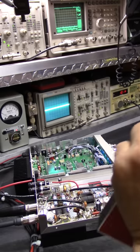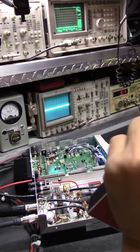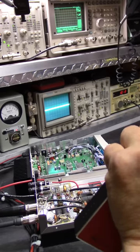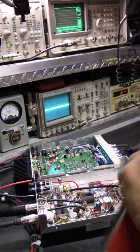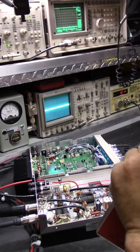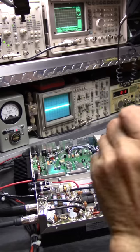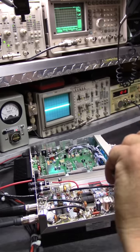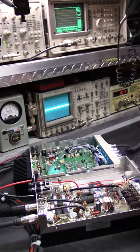Receive front-end overload reduces adjacent channel rejection. That can be a big problem, especially if you're in a truck or a heavily populated area. It could really piss you off. But that has a lot to do with who is inside your radio. So yeah, this one is just like the rest of mine. Awesome receive. And another AF mod that I do takes out even more noise and increases the signal to noise ratio, and also another dB or two on the signal. One or two dB in the right place means you're going to hear them or you're not, period. There are some videos on that on my channel.